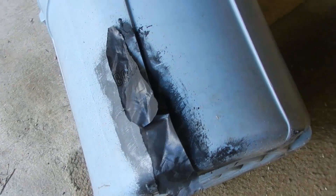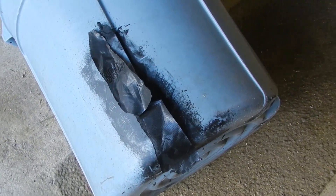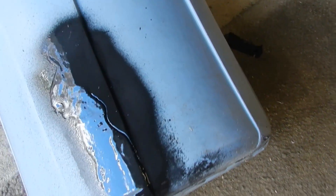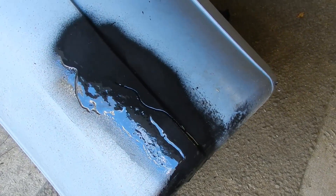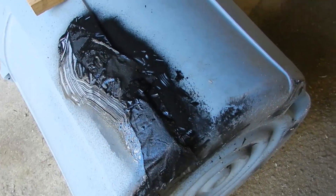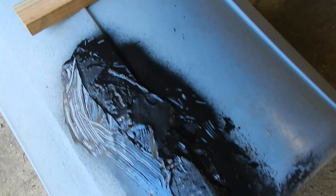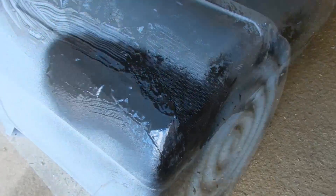First step: cut out the piece or pieces you need to cover the entire crack, and place them in spots just to measure them up. You're going to remove them then and move them aside. Spray the Rust-Oleum on there and get good coverage to cover the entire area that is going to be covered by the fabric, so it'll all be glued down into place. Then take your weed-blocking fabric and put it into place, getting all the air bubbles out and making it flat. I use a piece of wood to do that so I don't get my fingers too bad.